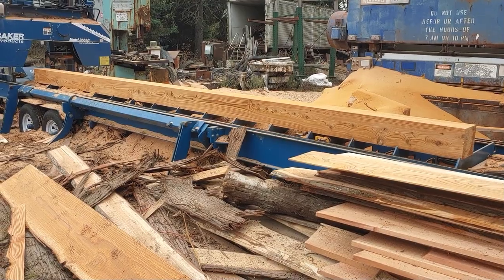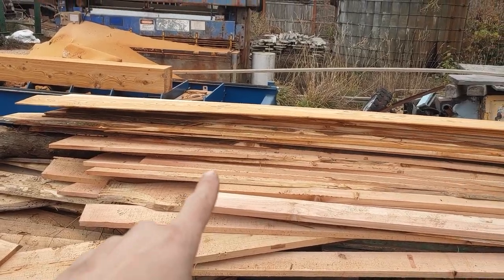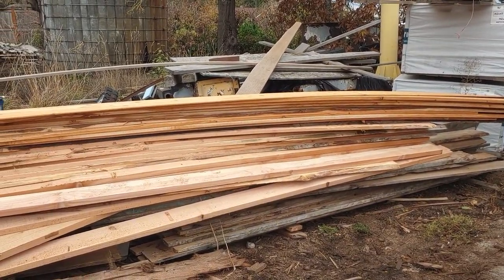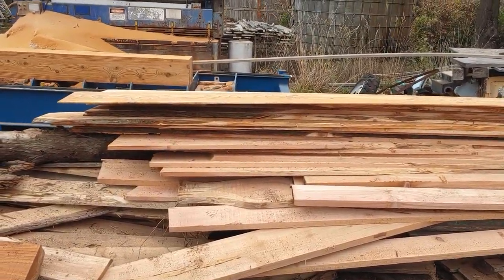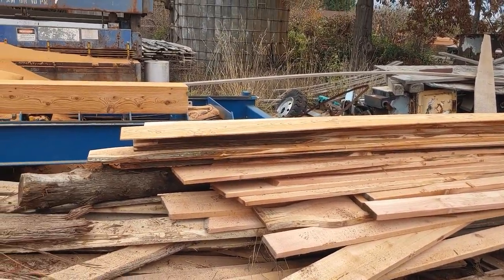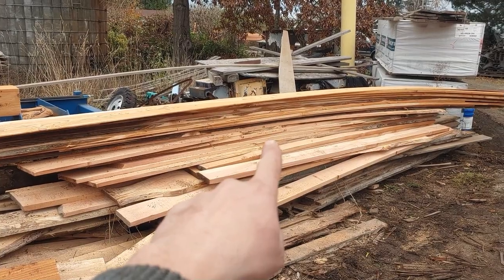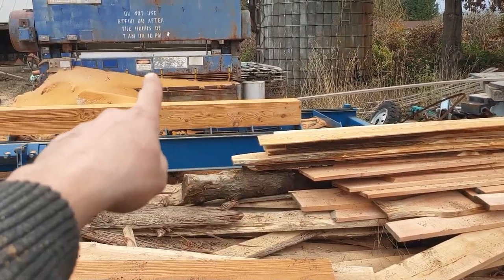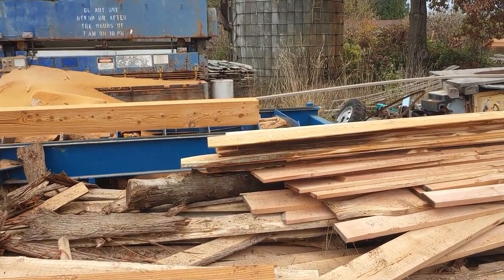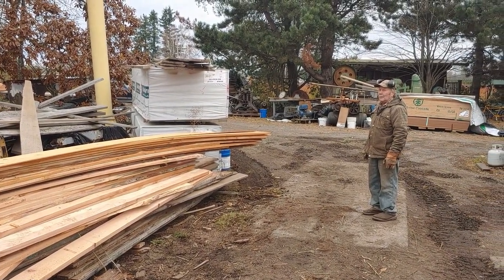Whoa, we made it. 22 feet long, 9x9. We got 10 pieces here that are roughly 6 or 7 inches wide on average. There's more in there that's wider. But I figure I calculated the log with a 14 inch top had about 190 board feet in it. In that pile, there's about 125 board feet. And that beam, there's about 150. So we scaled the log at 190, ended up getting about 275 board feet out of it. Fred's happy. Look how happy Fred is over there.